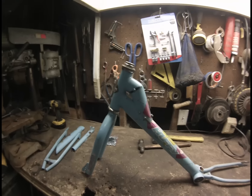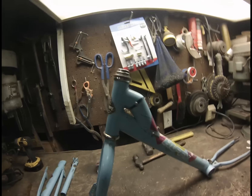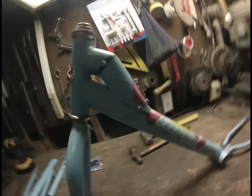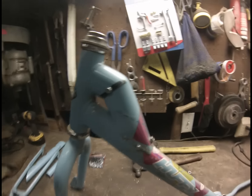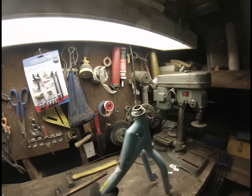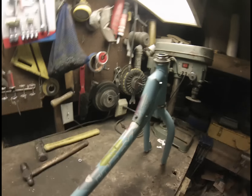What I did here is I cut the top part of this frame, then cut a slot in it and bent it down — I squeezed it so it folded inside itself. I cooked out the bottom part of this metal and hammered it into shape a little bit, and I was able to get some tapers in it. That'll really reinforce this neck. You want to take your time on this part — cut a little bit at a time, because once you cut it short, it's short. I got a pretty good fit on that one.